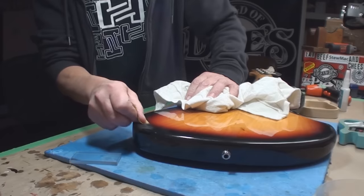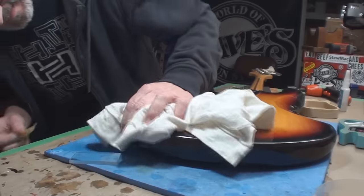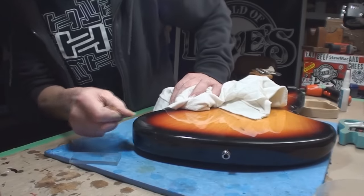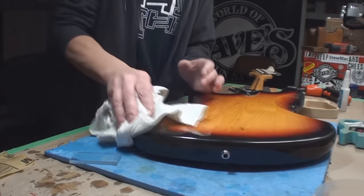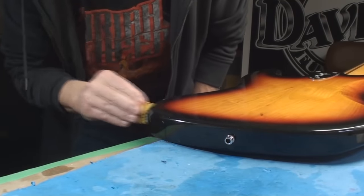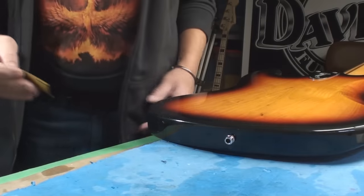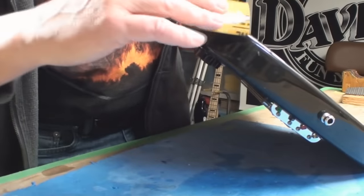There are going to be some witness lines where the Glue Boost met the old finish, and the only way you'd ever get rid of that is if you actually got an airbrush out. I'm almost happy. It's always good to have a lot of light so you can see how badly you're screwing it up. The idea is we're trying to build the finish, not burn through it, so we don't want to sand too much. I can see exactly what needs to be done. Now I'm playing with wet sandpaper and going through all the grits, all the way up to 2,000. You can see when it's wet what it's going to look like when it's polished — it's got to be smooth.